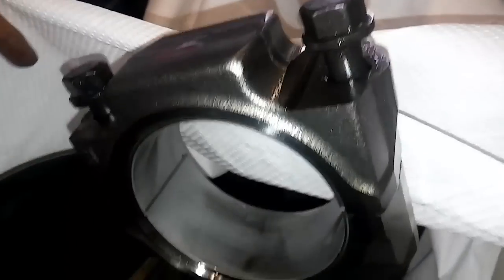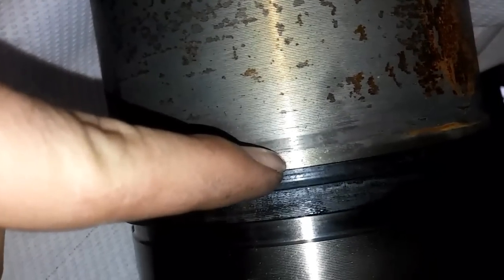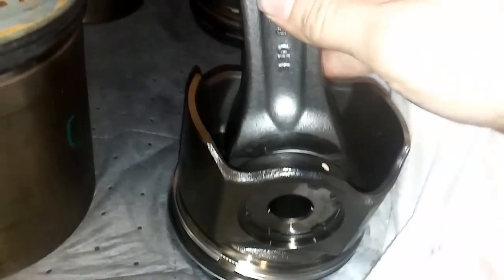Here's a picture of the pistons. This is a machined rod - they also come in fractured rod, but this one uses the machined ones. Here we have the liner. You can see there's no filler band at the top, and there's only a single O-ring. Unlike the C15s which have three O-rings, the C11s and C13s only have a single O-ring that seals the liners.